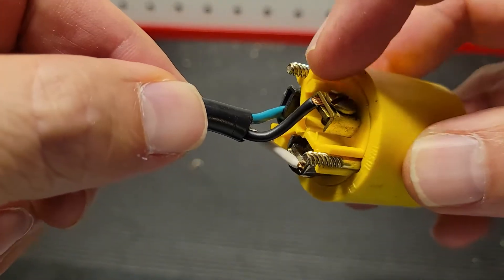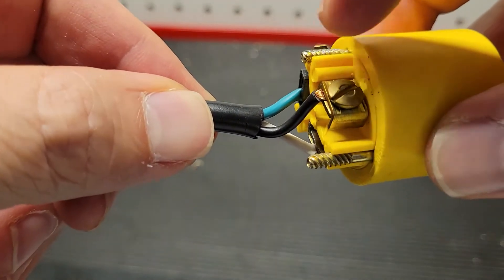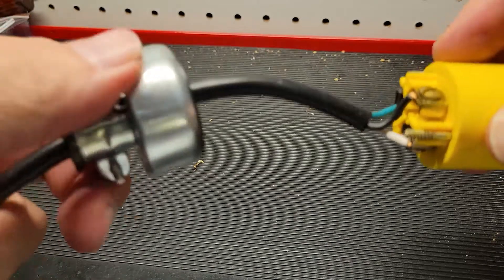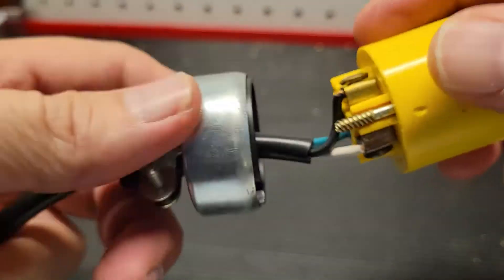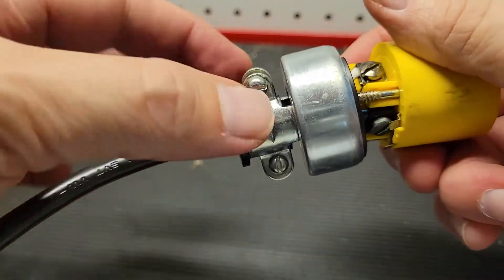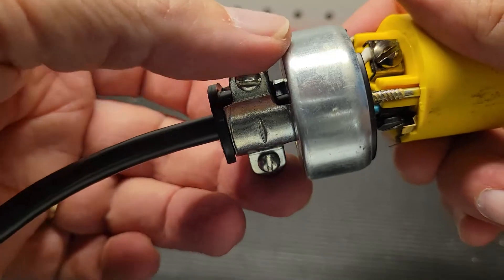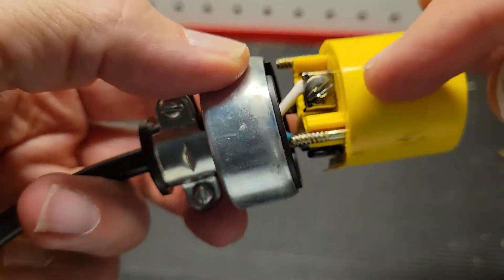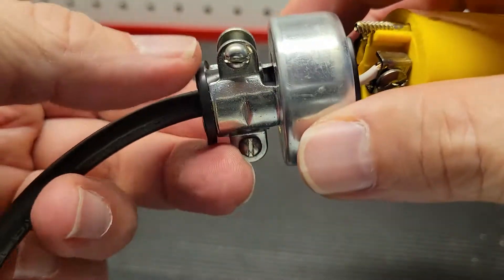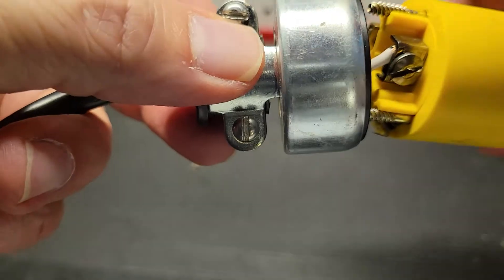As you can see, we've got a little bit of exposed wiring. If this was ground I wouldn't care, but this is the load side, so I'm going to have to fix that. Once I fix that, all we do is put this in place and tighten our screws to lock this part of the plug together. Then we tighten these two screws so that if someone pulls on the cable, the force is taken here instead of being transferred to the wires at the crucial end where they might come out.